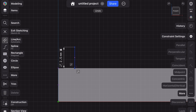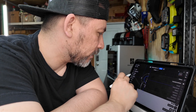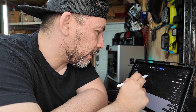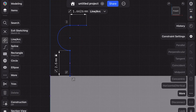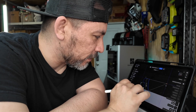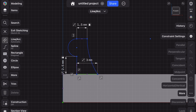I think we need it to be a little bit bigger, so let's go back, delete that, and go with a much bigger curve. We want to keep the thickness of the part, so we go back to our line tool. We keep it at 1.5 millimeters thick at the top, and then as we go down to the base, we make it even thicker — let's do a swoop. Now we have a really thick bottom, which is going to be plenty thick enough to snap in without breaking. Then we need to finish off the bottom line, and we can exit our sketch.